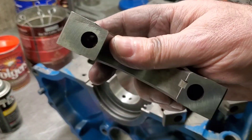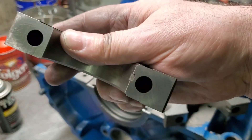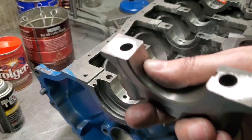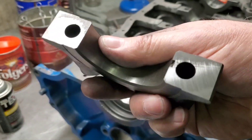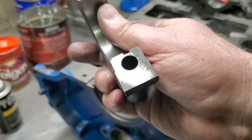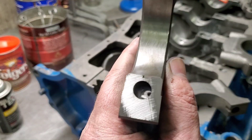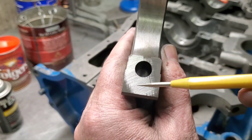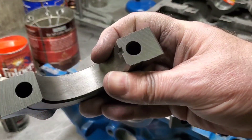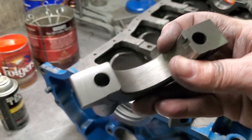This is our thrust cap — you can see we're cutting right through the middle there. I'm just hoping it will be straight to the thrust side because you never know what the previous shop did. You can see the arc finish from the grindstone in the fixture. We've taken about five thousandths off — looks real good. That cleaned up a hundred percent; we're happy with that.